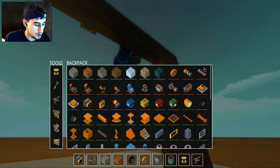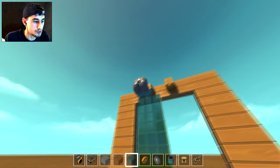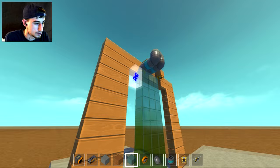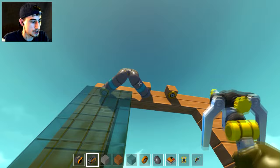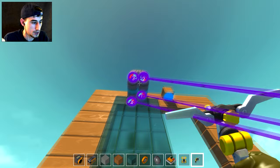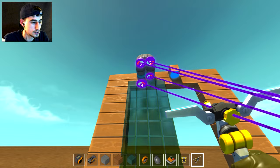We're going to make the doors out of glass — nice and easy to see. This is the closed position; when the arms are folded up they're closed, and then they extend to open the door. Hook those into the controller. The proper configuration is the first one toward the left, the third one toward the middle, the second one both in the same direction, and then the fourth one matches — so one and four are in the direction you want it to open, and two and three are in the opposite direction.